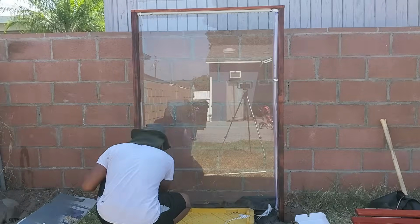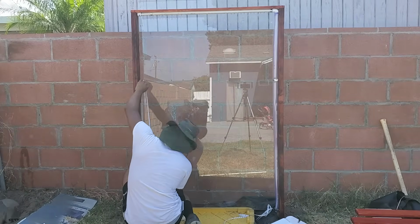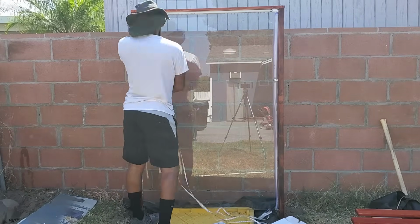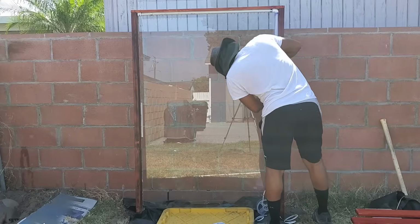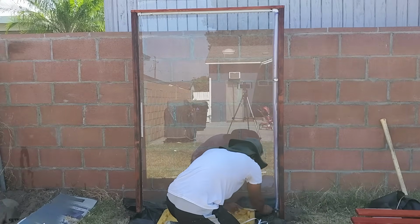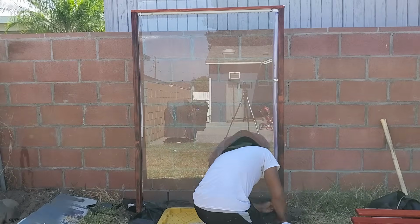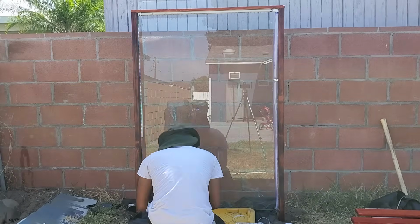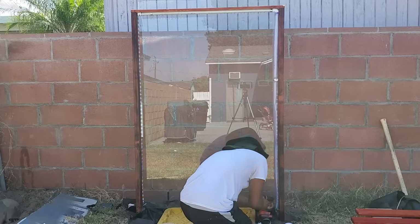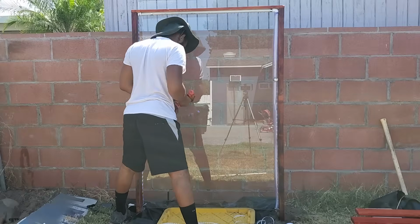So I just finished staining the wood. That's another mistake that I made. The way that it was stained, you're supposed to apply wood conditioner first and then go ahead and stain the wood. It comes out much better, and that's something I'll show in another video when I built my planters that are next to the fountain. The staining on that came out pretty good.